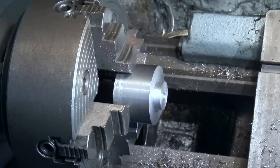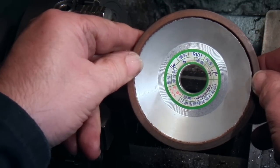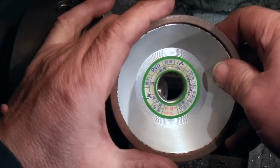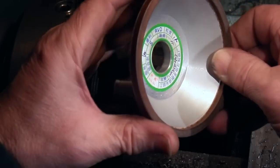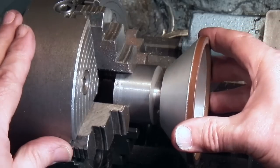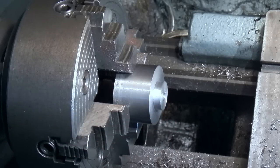So let's go into the workshop. I've just roughed out an arbor for the diamond grinding wheel. This is the diamond grinding wheel - it's an aluminium backing and around the edge it's got diamond grit bonded. So on this one I've just got to turn this diameter down to match that and get the right depth, then put an 11mm bore in to match the cutter grinding bore.